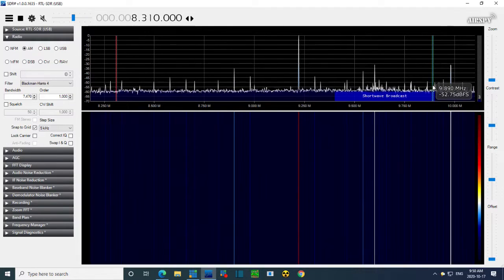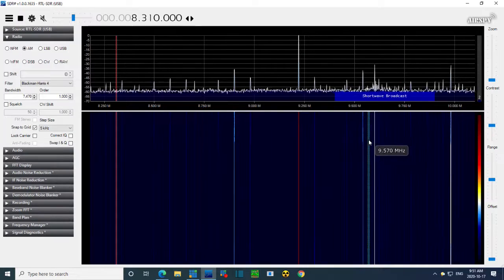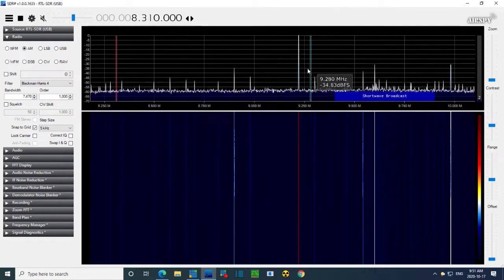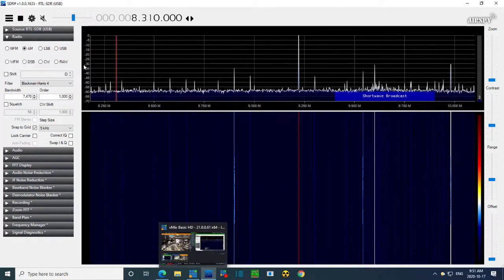Now before, when I did this same sort of study, at the end of it, I don't think I said anything, but I went away thinking, boy, I don't think that really worked out well. So maybe there's lots of confusion in this radio, some of it stemming from me and my activities here. Okay, so if we want to adjust the oscillator on this band, I have to check something. Yeah, let's do that. I'm going to stop for a minute and then we're going to do the oscillator on this band and try to push this thing up into the realm of where it should be and then see if the radio operates better.